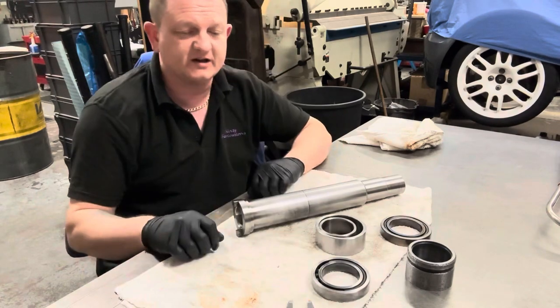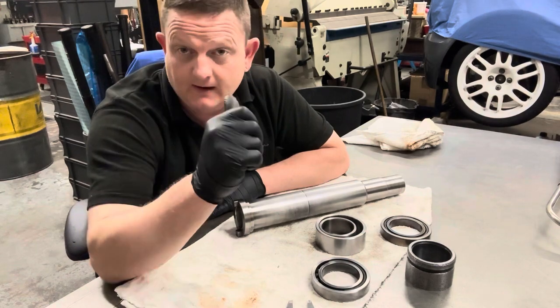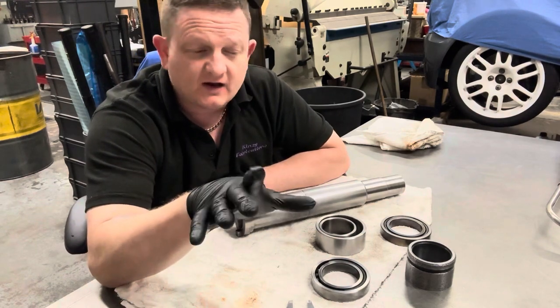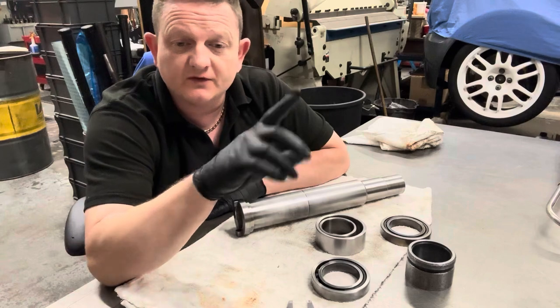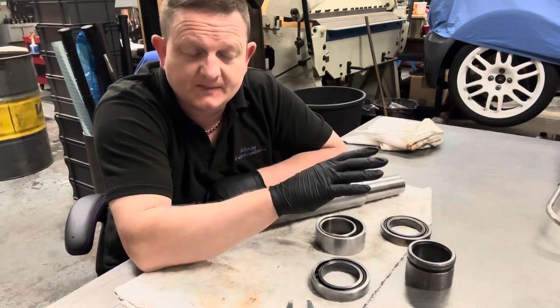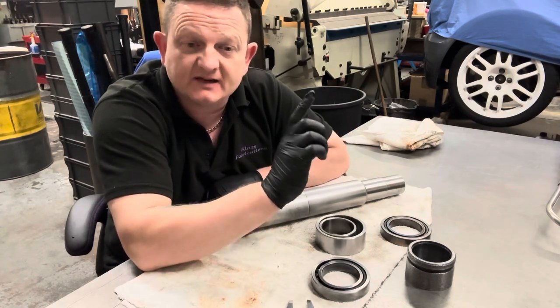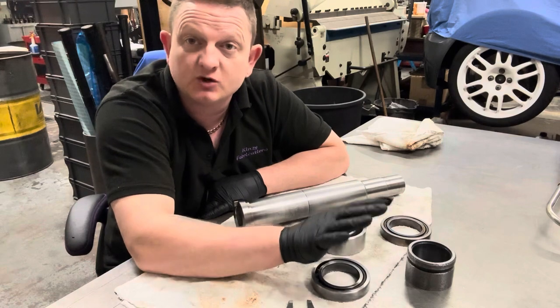Now, one last thing I wanted to add. The spindle that's currently in the VF3, if any of you guys watch your previous videos, you'll remember that the spindle that's in there now running was removed from a machine that I scrapped for spares. And the spindle bearings themselves are okay, but the taper sticks really badly and the tools get stuck.